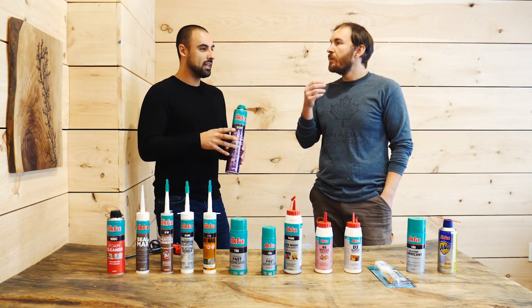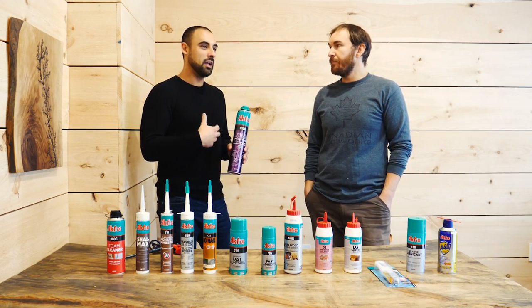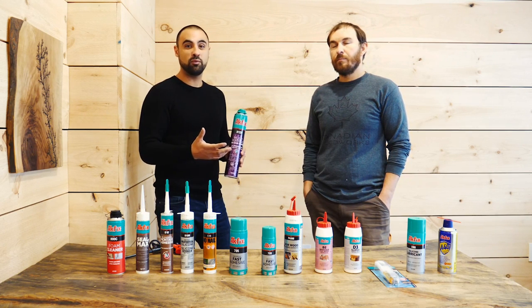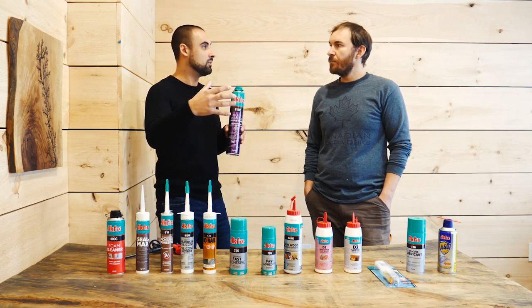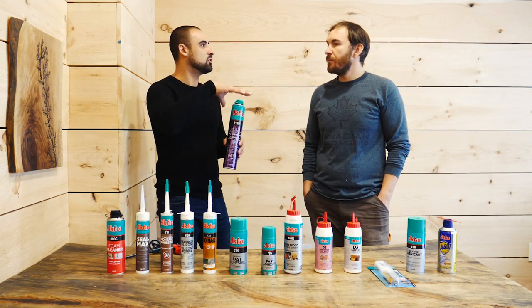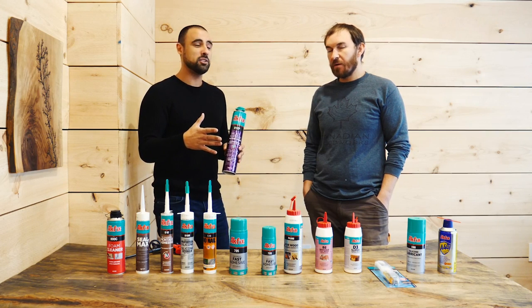No. What we like to call ours is actually a soft expansion. What ends up happening, and we've gotten this from a lot of customers that are actually using the product, so we get professional feedback, is they find that if they overfill a cavity, rather than bowing a window, it actually pushes out. So you get a little bit of overflow because they oversprayed it, but they don't have that issue of bowing the window. That's key with the low expansion foam.